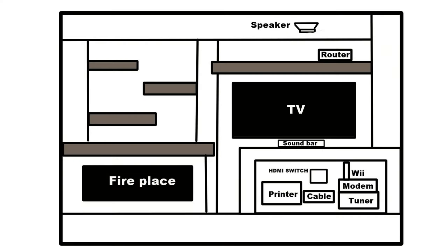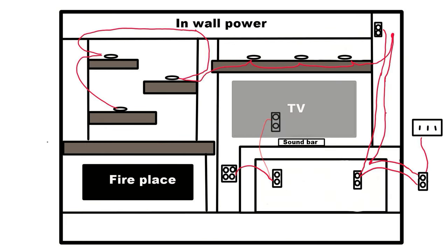The next step is to get a basic layout of the space with all the equipment in place, then illustrate the wires that are going to be needed. Start with the power. If you're not comfortable doing this work, I recommend having it done by an electrician. Here, I wanted the outlets to fall in the cabinet, so two existing outlets had to be tapped into to supply power to the two outlets in the cabinet. The outlet all the way to the right had the top part controlled by a switch, so that worked out perfect for my setup.